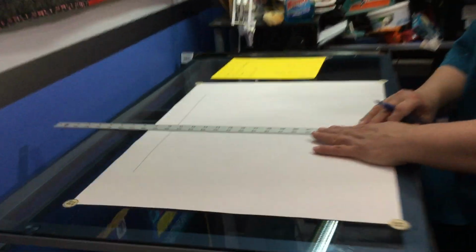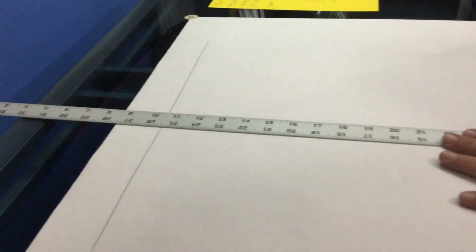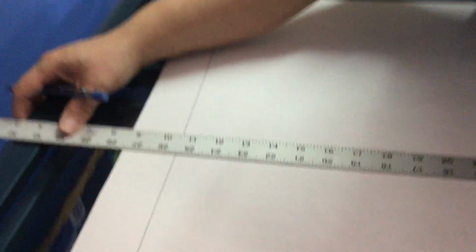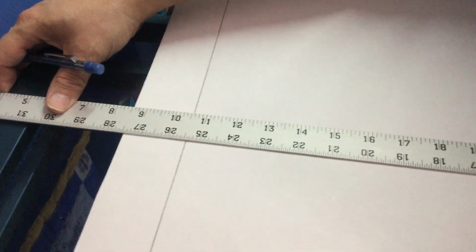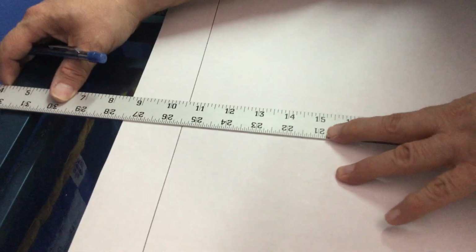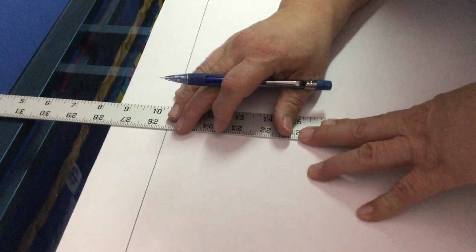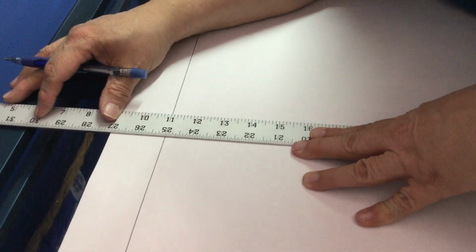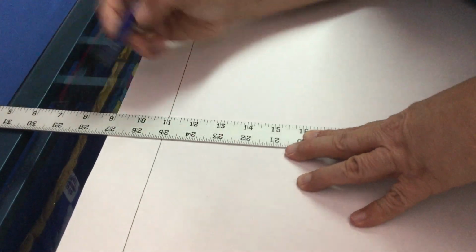Now remember, center line is a dotted line. Dotted lines are reference lines and imaginary lines. We can locate them, but the audience typically doesn't see them. So, find my two little dots. And this particular line, a center line, has a pattern. It is a long dash and then a short dash. And I know that I've got to put a border on my paper, and remember, nothing touches the border.